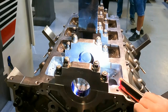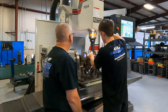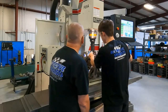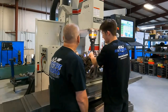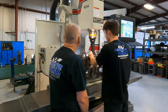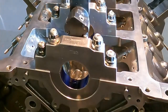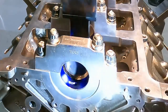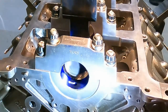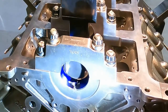This is something else you want to look for — chips building up. Usually the chip breaker does a pretty good job knocking them off, but if it doesn't, what I like to do is, as soon as it indexes up, stop the machine and make sure it's stopped because you don't want to get your hands caught in it. Then pull the chips off with a hand or rag, jog out the other locations, make sure you have adequate vertical clearance, and then start auto-cycle again and resume where you left off.